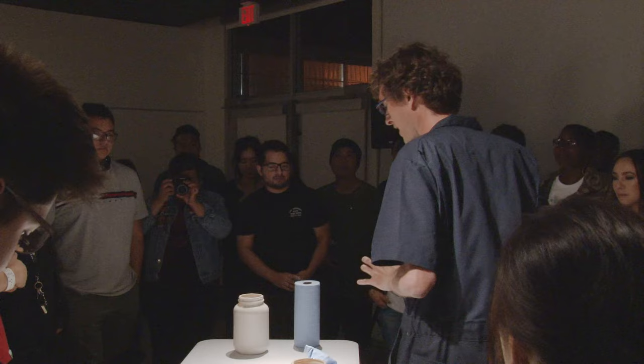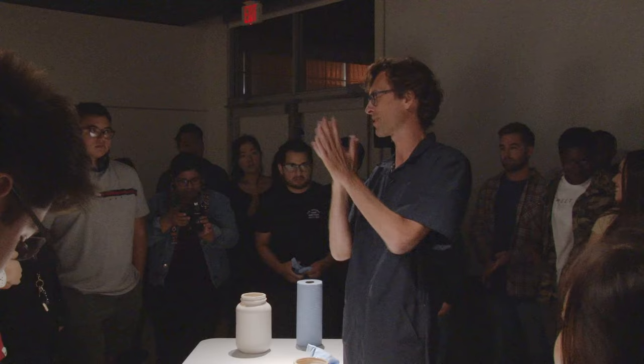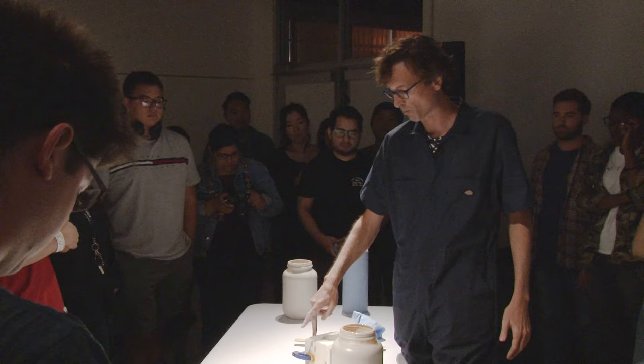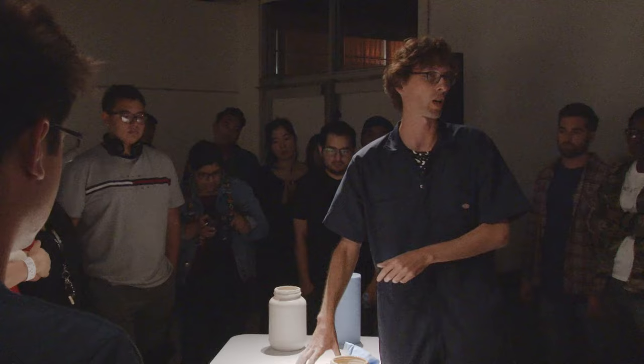But it has a chemical in it that's called a deflocculant that basically takes the clay molecules and lets them slide past one another instead of sticking on one another, which makes it feel like a liquid without having any more water in it, which is kind of awesome. Because what we want to do is use our plaster mold to draw all the water out. And the less water we have in here, the less work our mold has to do, which is awesome.